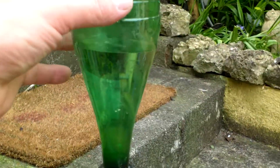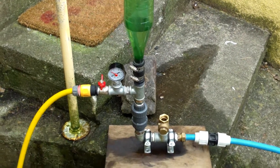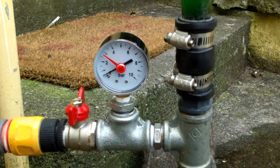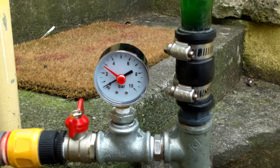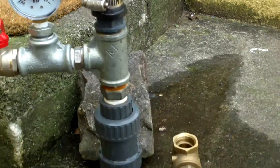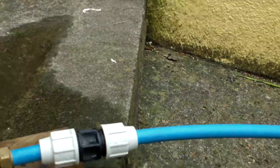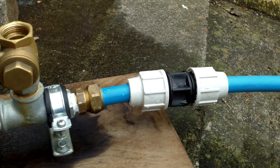The pressure vessel is made out of a water bottle — an old spring water bottle. I've just added on a little pressure gauge because I was interested to see what pressure my ram pump is running at. You don't need pressure gauges for the pump, it's just a bit of interest to show everybody. The usual setup here uses 20mm poly pipe. Ideally you should use iron as your drive pipe — this is the drive pipe — but that's quite expensive.